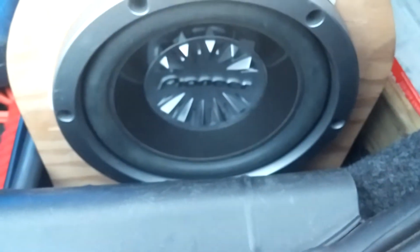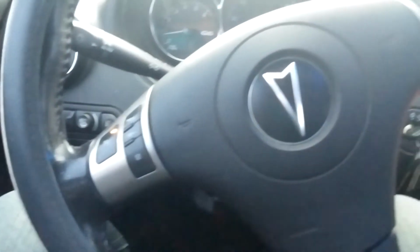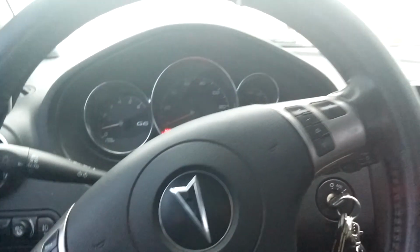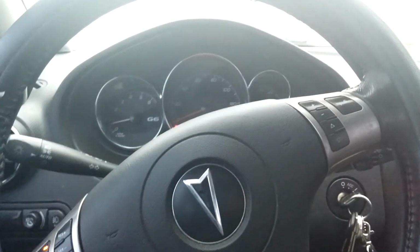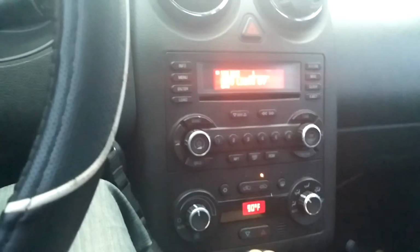These boxes are built. They're sealed subs. I got the boxes the exact volume that they're supposed to be, which is pretty easy to do. When you got just a tube, it really only matters what length you cut it to. And they were tuned to about 55 hertz. And I put some fiber fill in them, and they're down to 44. So anybody who says fiber fill doesn't make a difference, it'll make a pretty good difference. So it bumps. I mean, that's less than half volume.